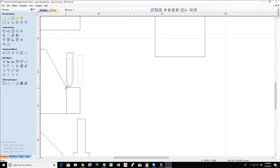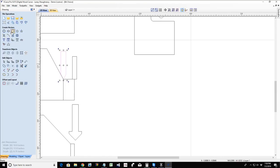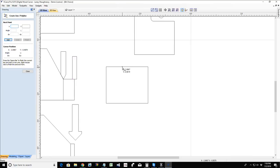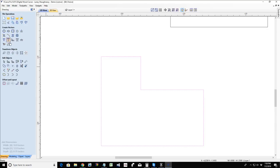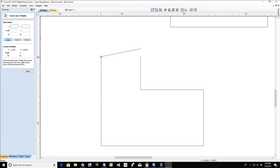Because as that bit is doing the flat depths, if there is any tear out caused by the flat depth, the V-bit is going to clean that tear out up when it does the V-carving, when it comes and cleans up those nice angles. So what will happen is, and let's see if I can draw this out. If I have my block of wood, my end mill is going to do that first cut. Let me get my 90 degree going on here. It's going to come and do that flat depth. And if I get any tear out up here, let's see if I can simulate this. So if I get any tear out at the top of the cut, let's see if I can simulate this a little bit better. Bear with me a second.